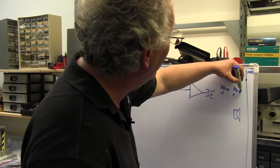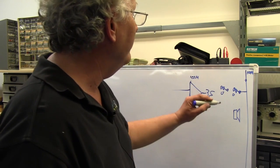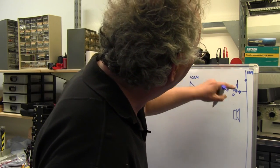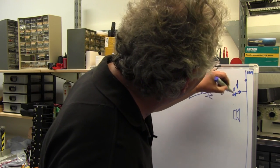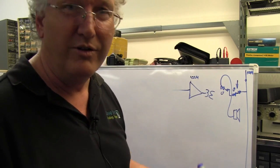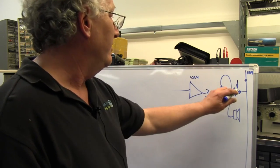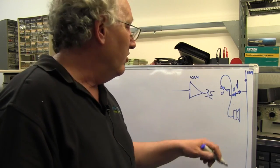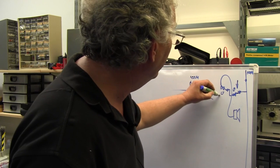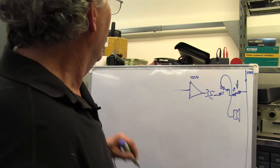In the off state, we want that circulating intercom line to go nowhere. We want that speaker to be dead. When it's powered on, we want that to switch down and allow that speaker to be connected to the intercom line, so that if there's somebody occupying the crew compartment, so that relay's energized, any audio coming through on the intercom line gets heard. And then, of course, if we hit a push-to-talk switch on a microphone, we engage that one, so that we send the amplifier output onto the intercom line. Got it. So far, so good.